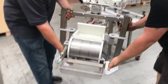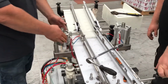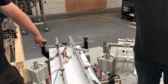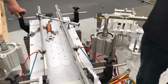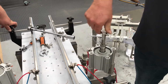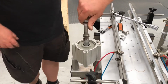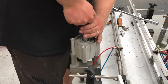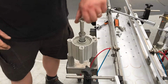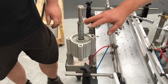So now you've got access to the pistons. This is what we're wanting to replace. So next we're going to strip this off and we'll show you how to do that in a minute. To work out which one's faulty, if you're not sure which one, you should probably have a good idea, but if you press down, that's all the way down, pull up, press down. Really smooth, nice action. Try the other one, which on this one, this is the faulty one. One mark, you pull. We have actually freed that off, but it is stiff. And it's a lot more difficult to pull. That one you can do with 2 fingers, that one was struggling. So this is the piston that we're going to change.